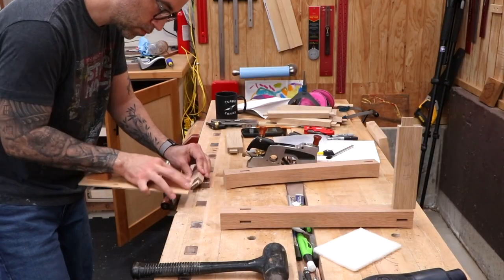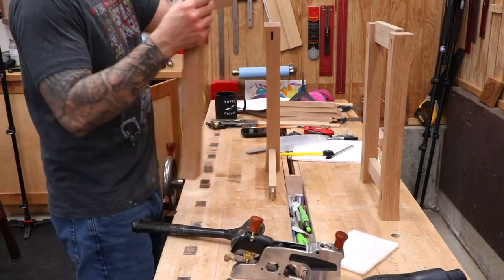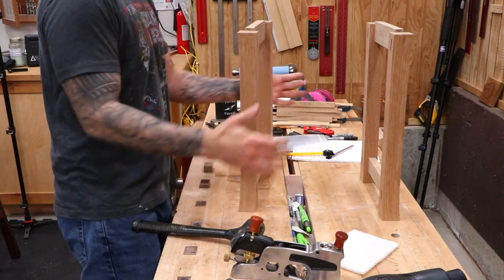So what happens when we jump to a traditional mortise and tenon? The number goes up to 988 pounds of force to break that joint. And if you take variations with reinforcement, you'll see results as high as 1,210 pounds. These numbers are significantly higher than the glue joint numbers we saw in Patrick's test.